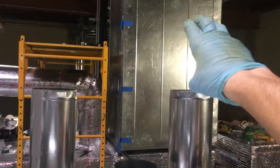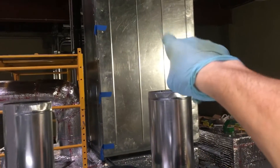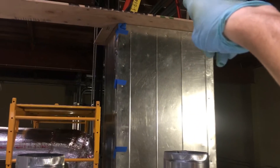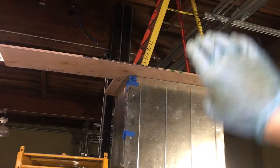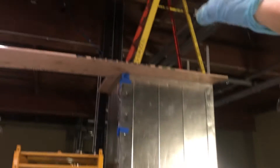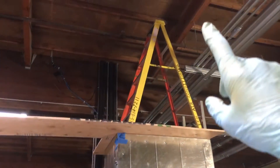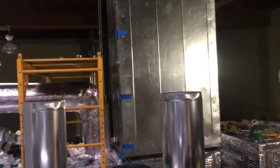The exhaust is in this carbon canister that we built — this cabinet will have the highly activated carbon in it. The room will be positive pressure and the air will just shoot the exhaust gases out of the room, going through carbon scrubbers and up onto the roof.